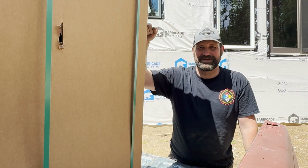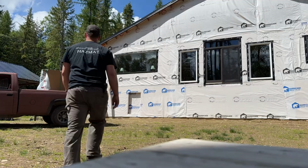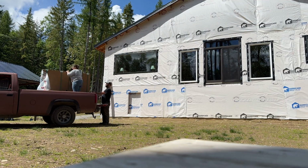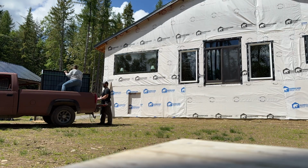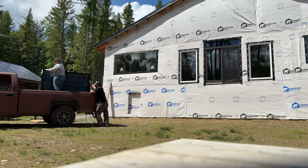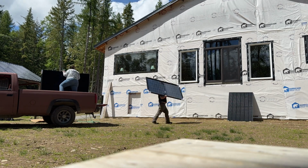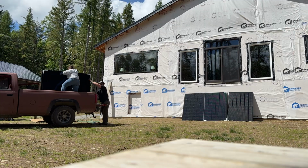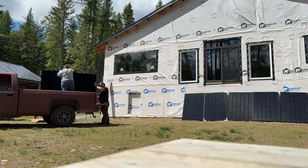This package came with 7 of the Sirius 418 watt bifacial solar panels. This mini split has a SEER 2 rating of 21 and an EER of 11.7, making it among some of the highest efficiency units on the market today. The easy do-it-yourself installation allows for quick refrigerant line set connections via the Quick Connect self-closing companion valves, which eliminates the need for special tools, equipment, or training. There is no need to pull a vacuum. The family of EG4 Solar Mini-Splits feature plug-and-cool DIY technology, the highest efficiency ratings, and a 5-year limited warranty.